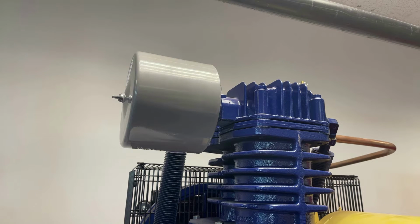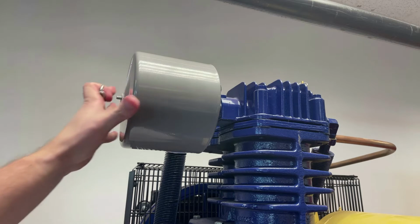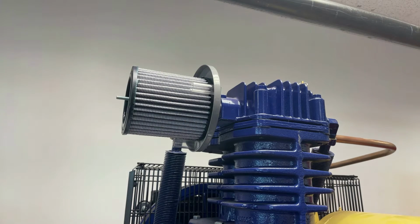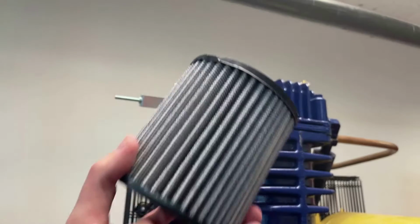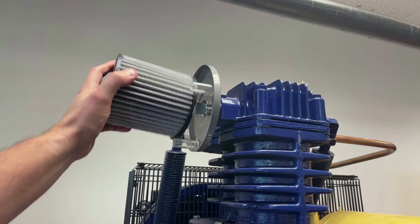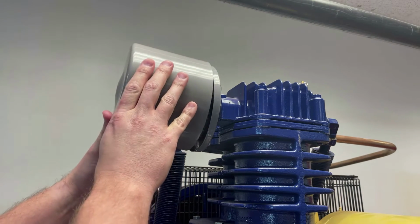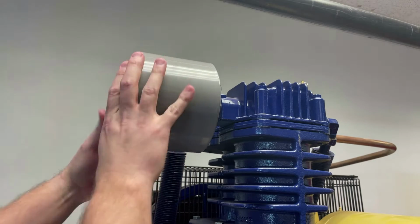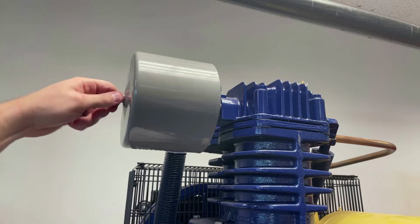When the pressure has been drained from the nitrogen generator tank and the air compressor, replace the air intake filter element. Remove the air filter cover from the compressor by unscrewing the wing nut on the cover and pulling off, exposing the air filter element. Remove the element by pulling away from the housing and discard. Using the new element, slide it on to the filter housing. Once positioned, replace the intake cover by sliding on to the screw stem and securing the wing nut.